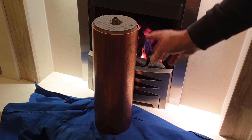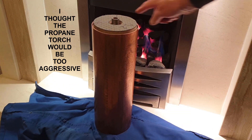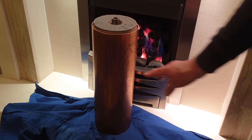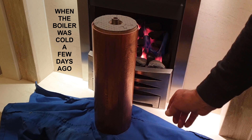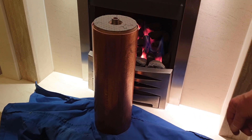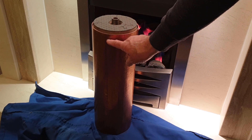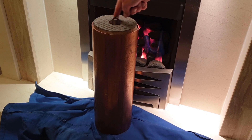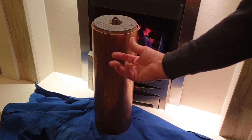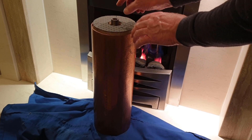What I'm currently trying to do is use the fire to heat the tube, to hopefully expand it such that I can get this former and the copper tube plate out of the barrel. I've had wood inside here and been hitting it with a hammer — it's really, unbelievably tight. It's been here quite a while now, maybe an hour, and I can feel it rocking. So I'm hoping this is going to come out at some point — perhaps you can hear it rattling a bit.